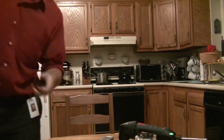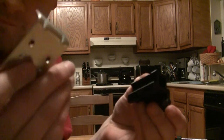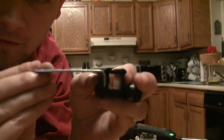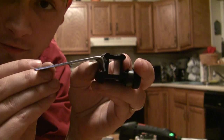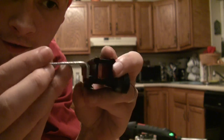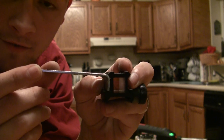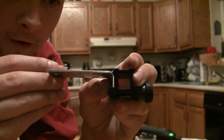So the cut is finished. If you cut it right, it looks something like this. Here's your riser, here's the cut piece — the L bracket should now fit right in there like that. If you notice that it's tilted down a little bit, try putting a washer between this piece and the side of the riser, and that should lift it back up to be even. If that doesn't work, you'll probably have to just cut a little bit more off the bottom. Either way, try the washer if you don't want to go through a whole another cut.